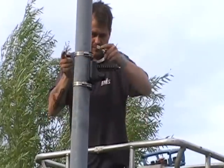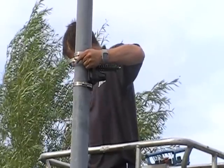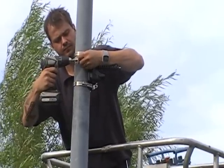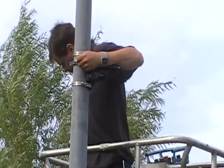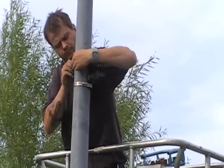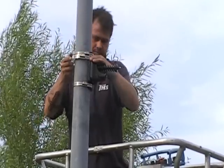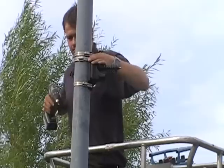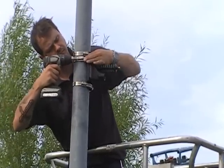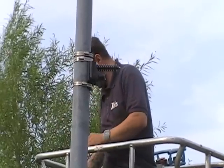The reason for this is that when the wind exerts a force onto the bracket, it's important it doesn't twist or turn before the spring has an opportunity to release the wind loading and diffuse the gust and the pressure that that puts onto the lamppost. We've got our three banding straps now securely in place.